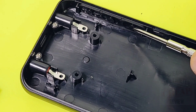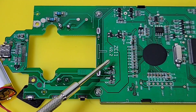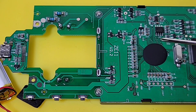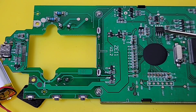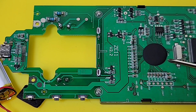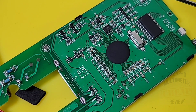On the back of the main PCB there's no shielding — no surprises there. Overall good quality construction, nice molding, and the metal inputs are in nice and snug. At the top of the meter are the three soft-touch buttons for capacitance, function, and flashlight. Interestingly, it says version 2.2 — the PCB revision. There are lots of diodes and SMD components at the top. The EEPROM is the TC4028, which we often see alongside a DreamTech IC — likely under the COB here. The display driver at the top is completely washed out with no markings. Overall a super clean, good-quality PCB.